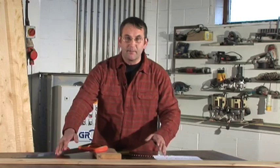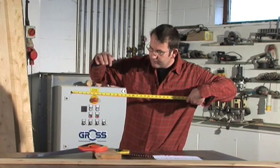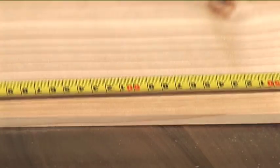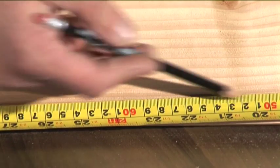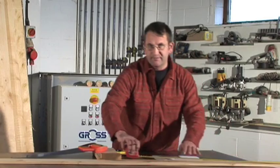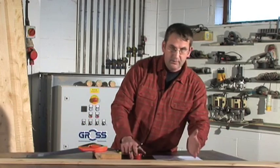So we're going to cut the piece of timber and we'll start from this end. As a general rule of thumb, you want to always lay the tape out along the piece of timber with the readings running from the left hand side to the right hand side. So in this instance, with the square end facing me, I'll put the tape on there, measure up, and put a line at 580. Take the tape off - what you can't do is measure multiples of 580, trying to be clever, because you won't allow for the saw cut. So just start off nice and simple: saw cut at 580.